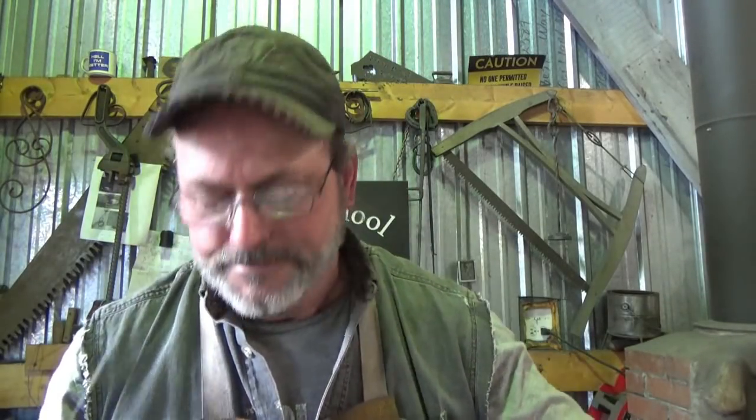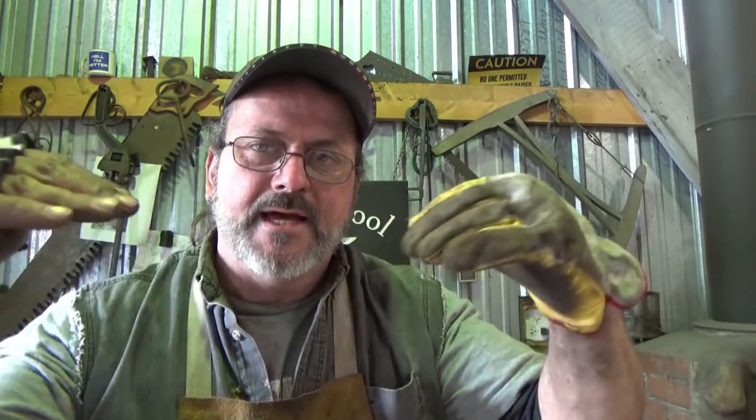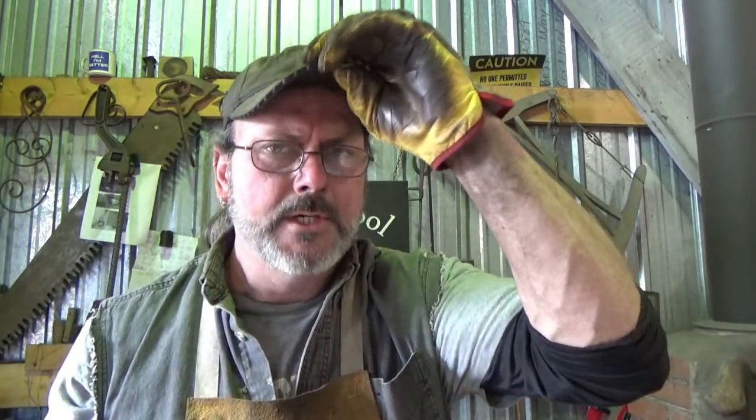I'm going to interrupt right now - we already did the exercise. I learned two things in this video, and I was going to cut it out and just start over again, but that's not the point of the video. Watch where I struggle the most, and watch how I figured out what I needed to do. The two issues were: when I was upsetting and trying to get more steel in a particular spot, and when I was trying to get a nice edge on the 90 degree corner - I was doing it wrong.